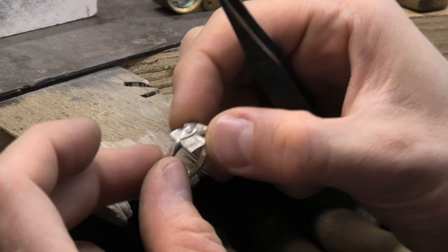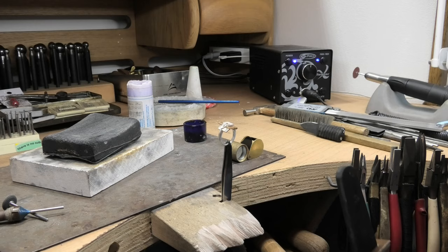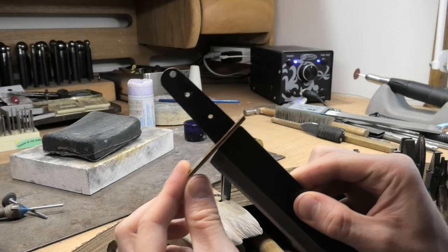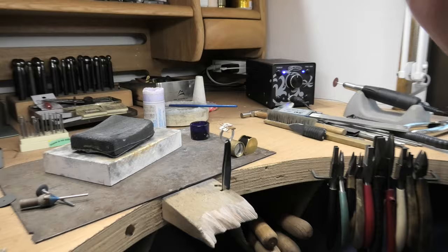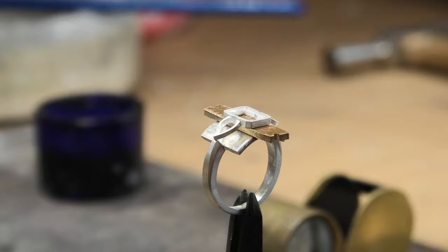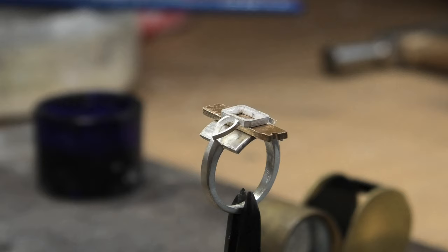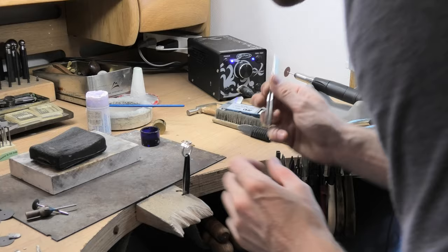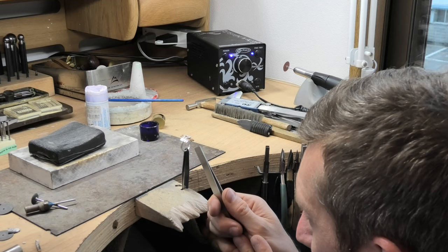If you're working in gold you could clamp it in the middle. I'm making a new handle for a knife and I need a thick bit of metal — I was cutting up a sheet of copper, so I'm building a little hand guard. I had these little off-cuts of copper. I just flattened the sides, took the burrs off, and it just sits perfectly. I'll flux it both ends — that almost acts like a bit of glue to hold it in position — and then just gently touch a little bit of solder on there. Take your time getting this into position — it's got to be lined up left and right really perfectly.